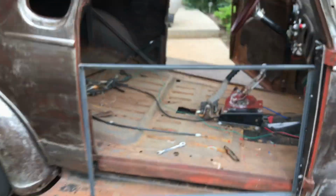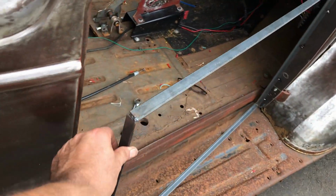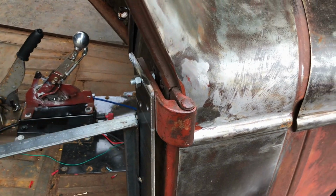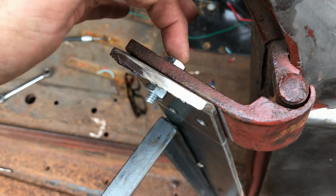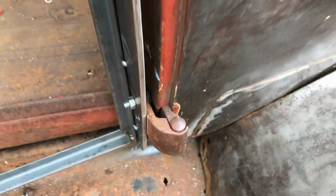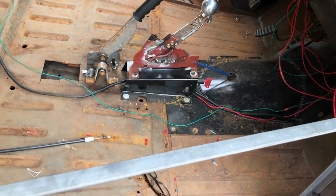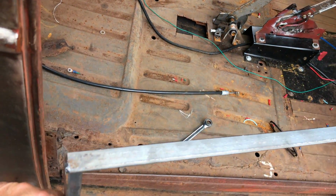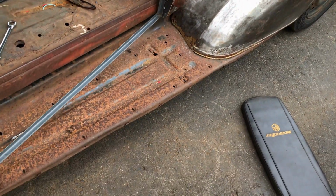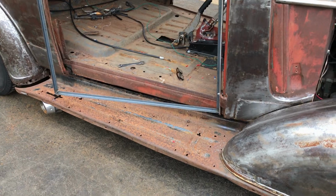And this is why I wanted to do semi-permanent tack welding, because as you can see, that's not closing enough, which means, well, I've still got the proper bolts to go in the back. Obviously that's restricting how far it closes, top and bottom. So I could start with that before I go too crazy with the angle of this, because it does need to come in about 7 inches. The theory's good. Right, I'll be back with an updated hinge section, okay?